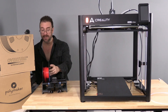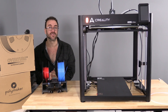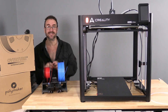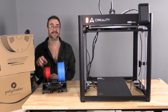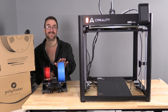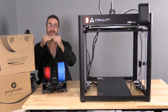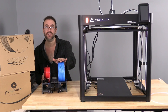The way it works is you load two filaments. I'll use different colors for demonstration purposes, but let's say with this giant printer you need a lot of black or white — you would load this device with two spools of the same filament. When the first one runs out it will automatically switch and begin feeding the second one. This second spool will chase the original in the Bowden tube, up against it, moving together until it's into the hotend and now you're printing with the new spool.